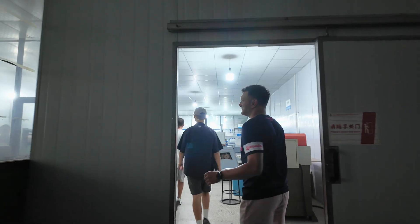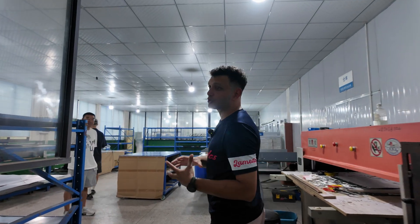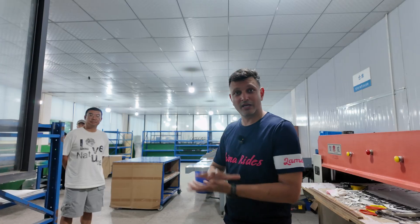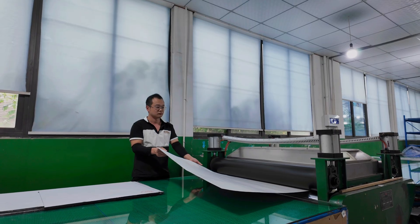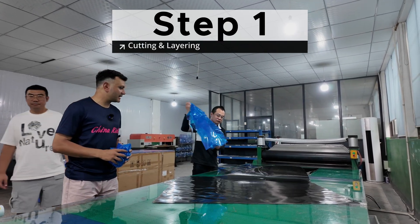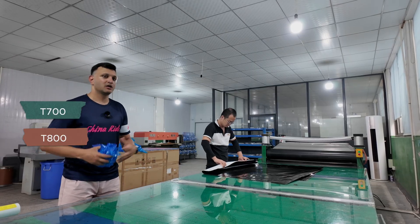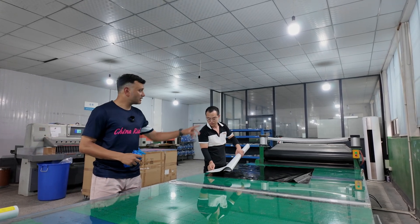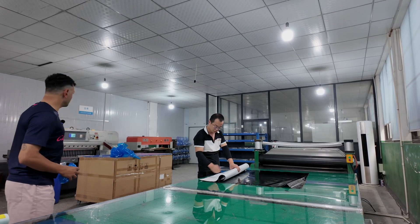So this is the workshop. I'm here with Mr. Wang and Liu Shan Shan. They're going to show us the first processes of how they put the template together — the carbon sheets, how they're cut up and layered together on the template. Right now they're taking care of the layering process. They take different sheets of carbon, anywhere between T700, T800, T900, all the way to T1100 carbon, depending on the spec of the bike. They layer them up for the tensile strength needed, flatten them in that machine, then cut them to the right templates.